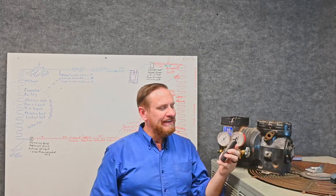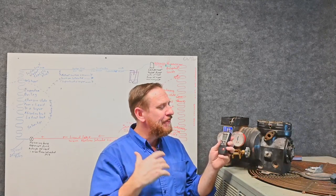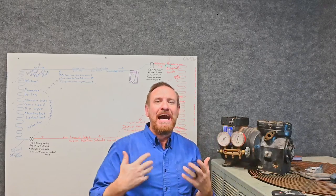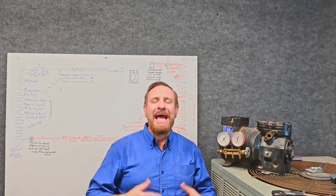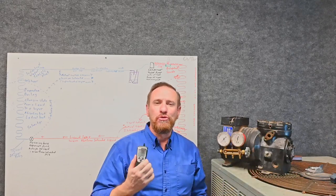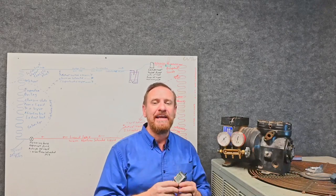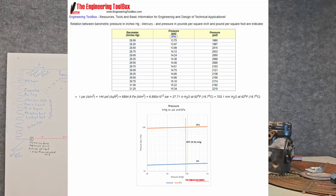I use a little device that, when I turn it on, gives me my PSI A — my atmospheric pressure. Right now I have 13.7 PSI of pressure on me, so I'm a little bit above sea level. That's the number I'm going to use. However, if you're taking a test, they're going to want to know atmospheric conditions, so simply add 14.7 — that's what every HVAC test I've taken uses. If you're doing this in reality, you'll want the true pressure. You can also get the barometric pressure and convert that. The engineering toolbox has great formulas and calculators to help you find that information.